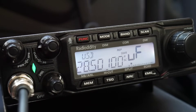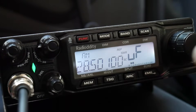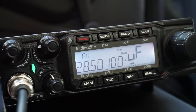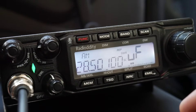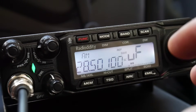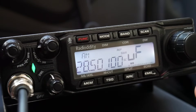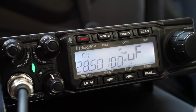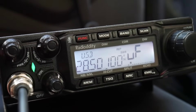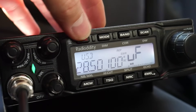Before I start playing with this radio, I should go to the AM mode and test the SWR on this antenna. This is a very good feature of this radio — it has an integrated SWR meter and also high SWR protection which you can turn on or turn off. Here on the 10 meter band the SWR is 1.1. I am on the frequency 28500. You can also change the backlight colors on the QT-80 with the function button and the band button.